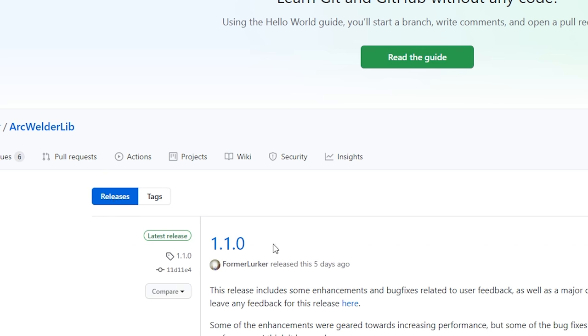I found that you can run about 200% feed rates over the serial cable, but the SD card is really where it shines — I was able to get a 400% feed rate over the normal 60mm/s settings. Using Arc Welder is really rather simple. You've got a number of different options: you can use it inside Cura, or if you don't use Cura, you can use it in Octoprint or the command line version. The command line version is pretty much universal and works on various operating systems, so you're not stuck with Windows only or only Linux. Links for all that are down in the description.